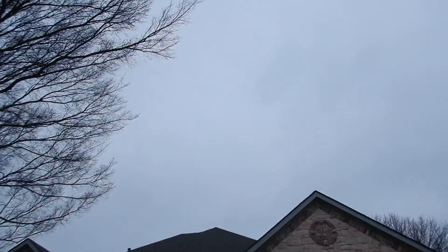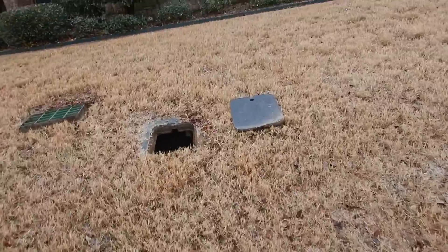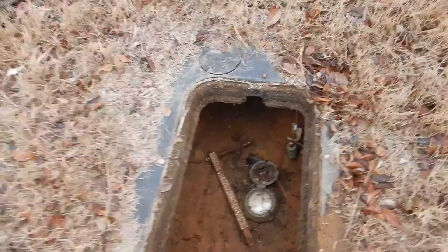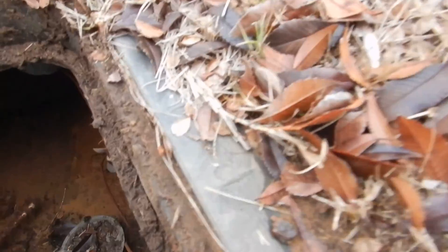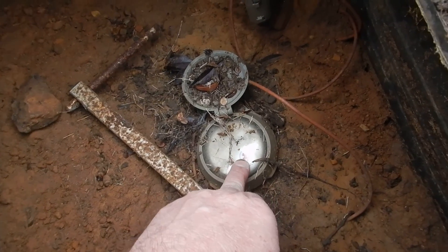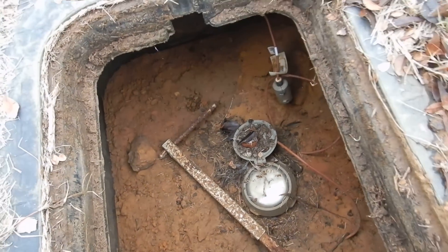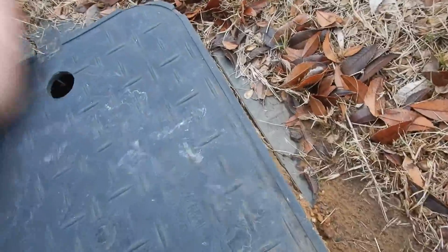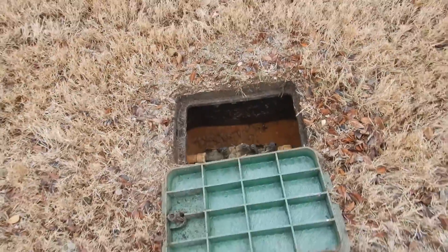It's a beautiful grade, about 50 degrees. This is the water meter in the front yard, about halfway to the street. A lot of times they're kind of buried like that. What we're looking at right here is a cheater wheel or a cheater paddle — it's actually a flow indicator. It's a very sensitive dial. If that's moving, water is moving into your home, so go find the leak. Is it a commode running, a dishwasher running? This is the check valve for the lawn sprinkler system.